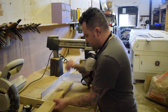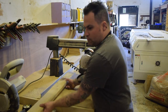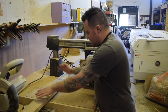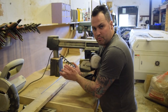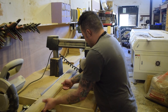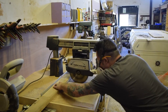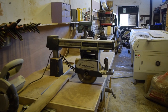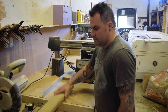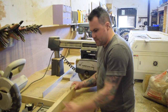Because there's a real big bow in this piece of timber, as you can see, we want it to be cut like this. We don't want it to be cut like that, because when the saw goes through it's going to collapse against the blade and pinch the blade — we don't want that once the waste piece is off. So this is where we're going to cut in. Make sure you wear glasses for something like this because it could be a bit dangerous.